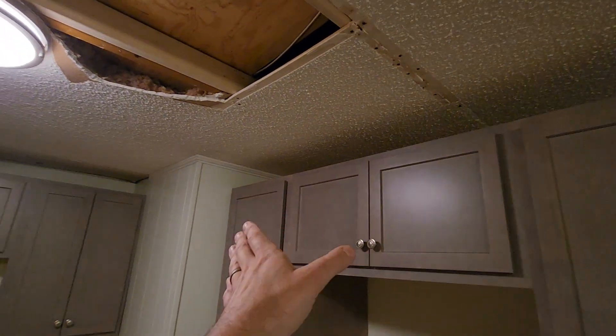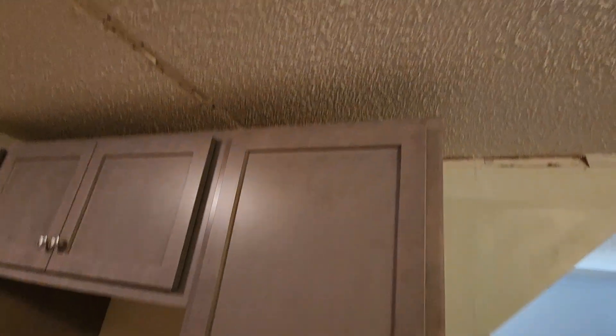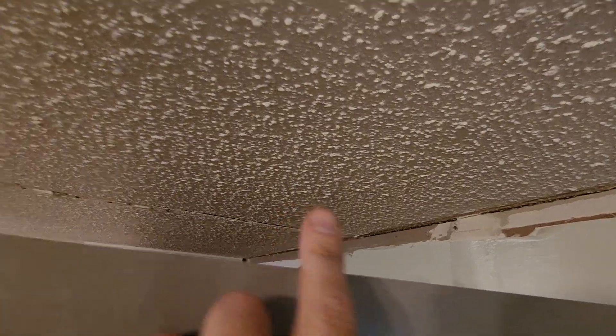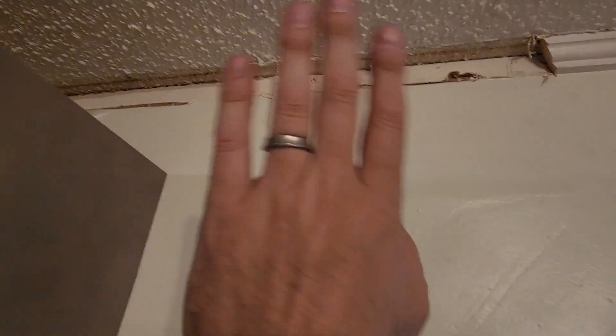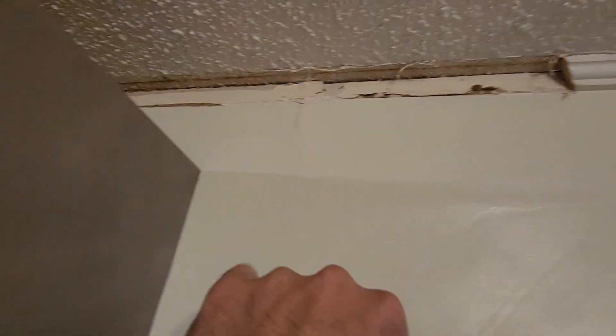It's going to be nice for us to just go straight up with the molding to the ceiling. We do have plans where they're going to be finishing off the house crown, because there's a piece they've taken from here all the way back — lots of material to do between those two wall cabinets. This profile was cut so that when they return the house crown back to the wall after our crown goes on, it'll marry up really well right there.